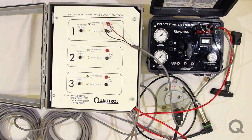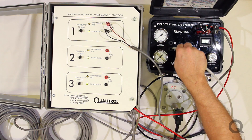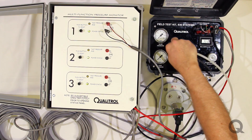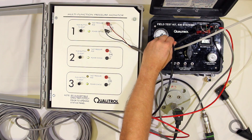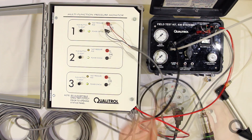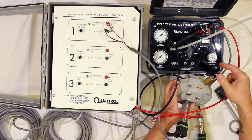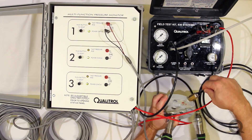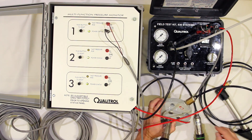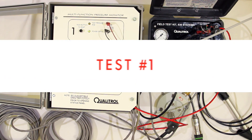The next thing to do is to get everything ready to pressurize. We've got our pump with a quick connect fitting that goes to air in, and then we have our output, which in this case I've hooked directly up to a transducer — that is air out. We have another output available that can screw right onto the flange, so you'll have your flange valve and likewise a hose that would hook up to your air out. And so now we're ready to start testing.